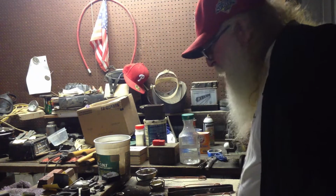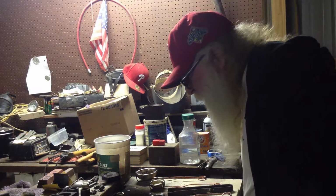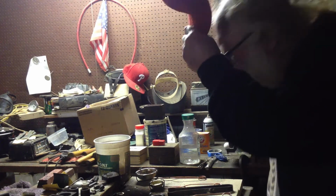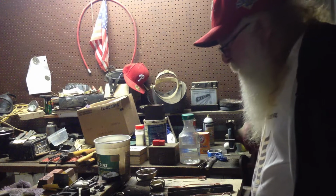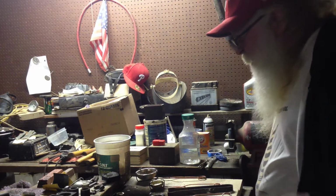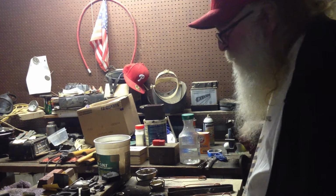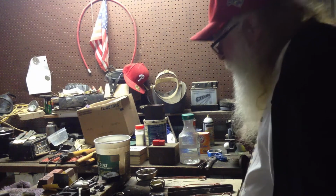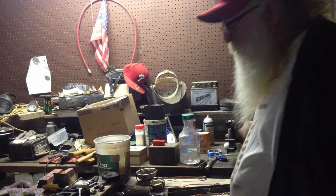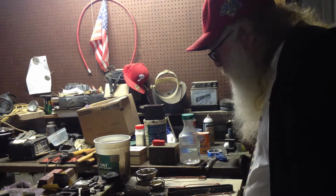That looks a lot better. I don't know if I was trying to pour too much silver. I cut it back a little bit, and now it looks halfway decent. We'll see what the bottom looks like. If we get a good impression, then we'll know. Maybe we don't want to try to pour so much silver, or we want to use the rosebud and get a little more heat on the sterling. Because like I said, as soon as you take the flame away from it, you can see it starting to harden up.